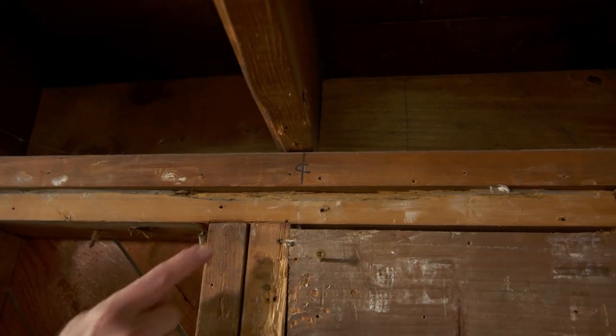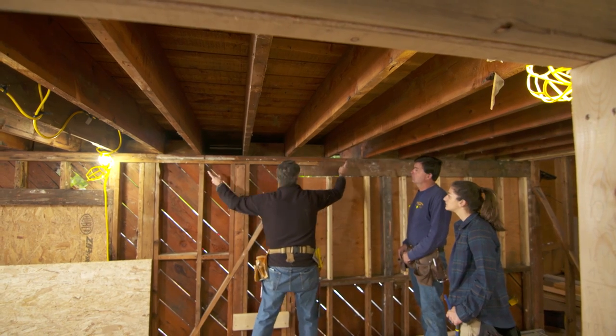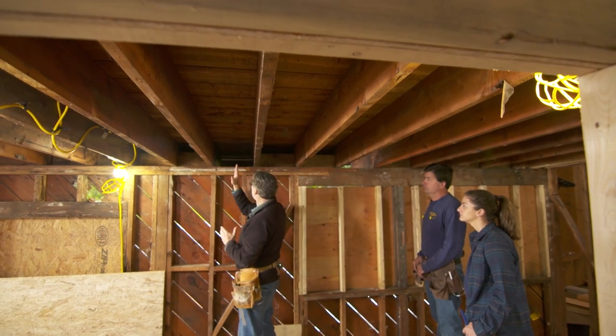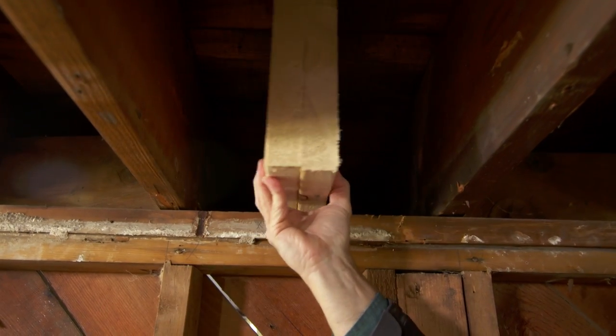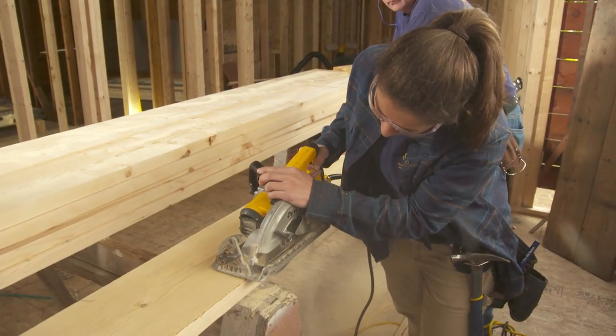So, we've done some layout. Here's the center line of the skylight, and it's going to go out to this end and this end, which means we're going to have to cut some of these out in the middle. But before we do that, we want to put the rafters on the ends. So, we're going to double up some 2x10s, and they're going to sit on top of the exterior wall and on the bearing wall in the middle. That's where we'll get started.